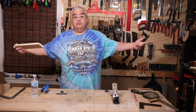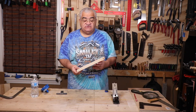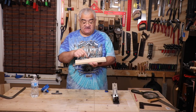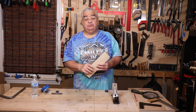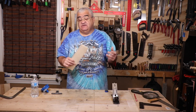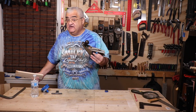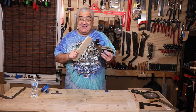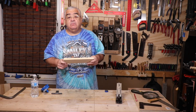This holds true whether the board is eight feet long or a foot long. Getting perfectly flat faces and edges squared to one another is vital, then getting the second face parallel to the first — bringing it down flat — is what gets you to what we call S3S, surface three sides. Everyone says, 'I'm just starting out, I can't do that.' I understand. You need a jointer, planer, and table saw in the power tool world, or you can do it with hand tools, but that's a skill you're probably not going to pick up on day one.